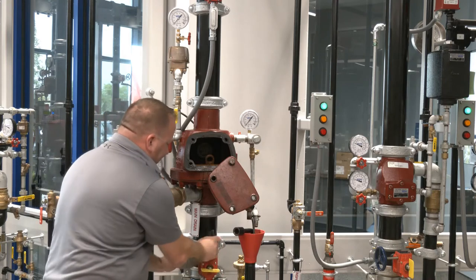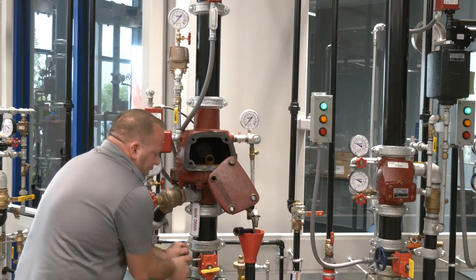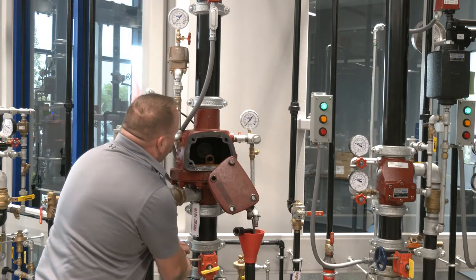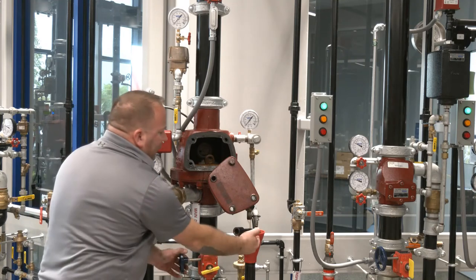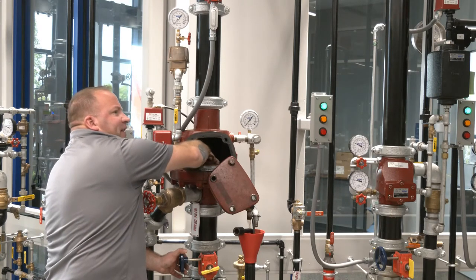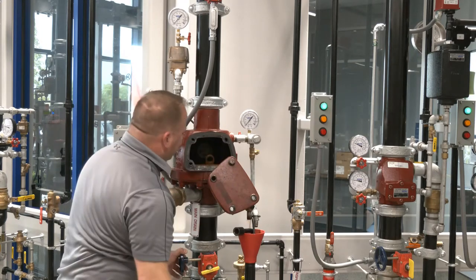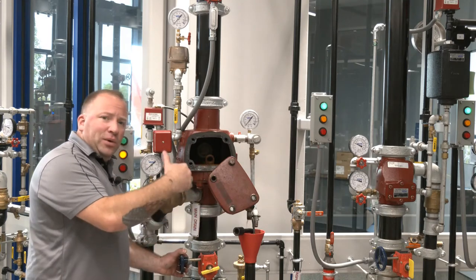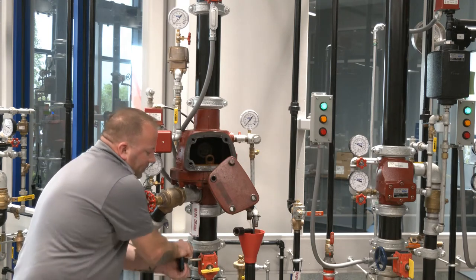If there's a little bit of debris, one thing I can do is take the system control valve and throttle it open slightly, so we get a little water coming up into the valve itself. That water will go into the intermediate chamber and out through the drain. With some water in here I can use my hand to make sure the valve seats are nice and clean and the clapper is clean as well — that may be just enough to confirm the valve is in good shape before we drop that clapper. Now if there's a lot of debris we may need to do a more thorough cleaning, but in this case the valve is in pretty good shape, so I'm going to shut the system control valve back down.